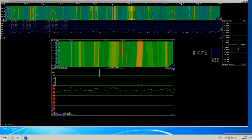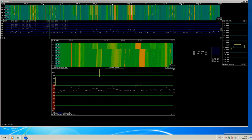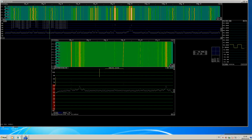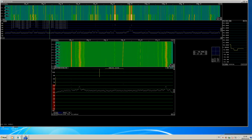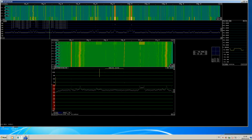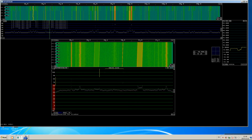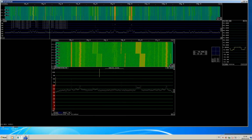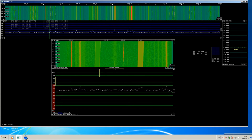I will now switch in the attenuator to make all the signals minus 70 dBm. And this looks good. Now I attenuate, and here we have the interference again. Going from 21 to 18 dB gain in LINRAD in linearity mode means reduce the LNA gain and increase the IF gain a little bit to get the desired gain change for the total gain.